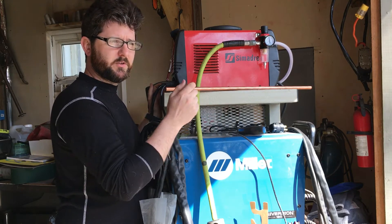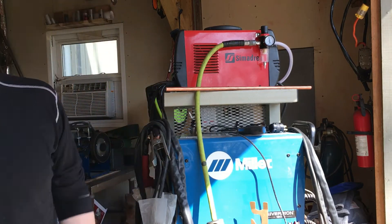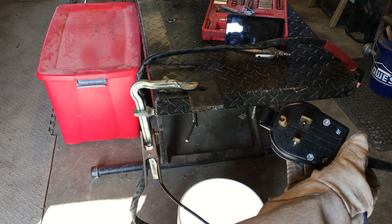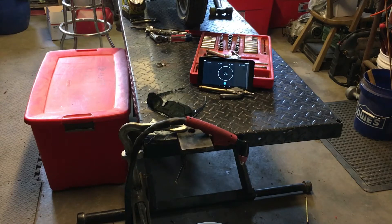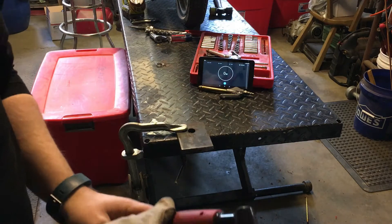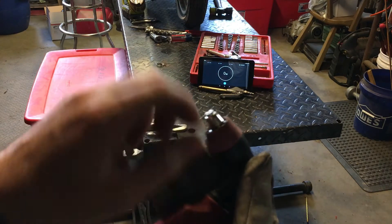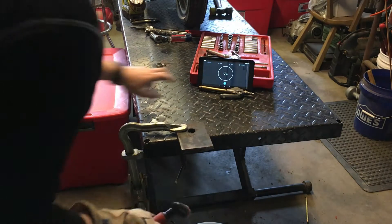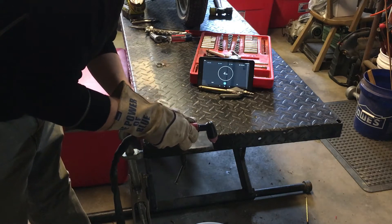Let's set up a piece of 3/8 inch steel and a timer, cut at 220 volts, then do the same thing on 110 volt after rewiring the plug. First we'll do 220. All right, got everything set up, machine set as high as it'll go — 51 amps — with brand new consumables, both the electrode and the outer piece. Nothing to it but to do it.